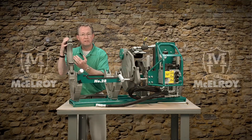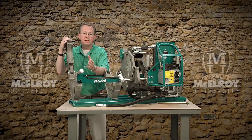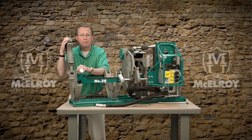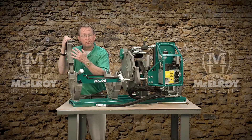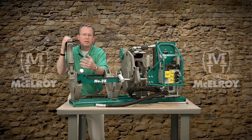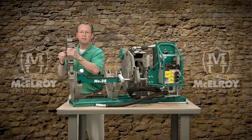The jaws are wide, robust, and made of cast aluminum that is hard anodized for durability and corrosion resistance. The jaws are sturdy enough to assist in re-rounding the pipe to help achieve the best fusion possible. All McElroy jaws and inserts are serrated, which allows the jaw to hold onto the pipe better, so whenever you are moving, clamping, and adjusting the pipe, you are less likely to have the pipe slip in the jaws. The inserts are easily installed and removed.